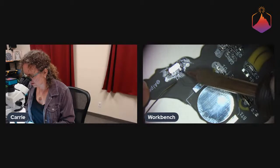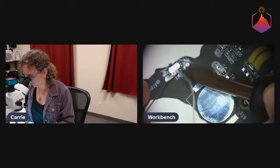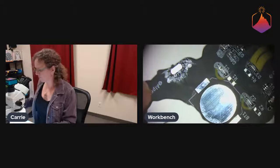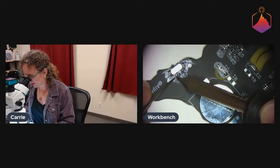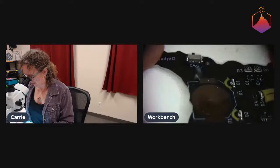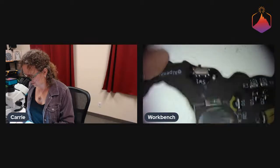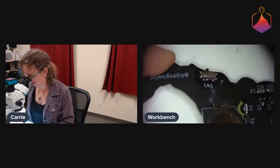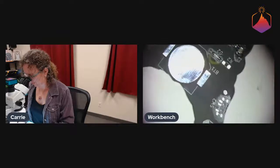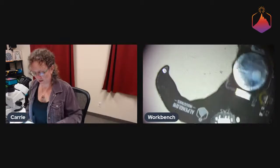Ideally this pad would extend a little bit further so we'd be able to get more surface area of the iron on the pad and heat it up at the same time. So I'm coming in from the bottom and blobbing it a little bit. The blob of solder helps it flow because the solder makes contact where the iron can't. So, that is not beautiful, but it'll work and I'm cool with that. All the way around, you can tell it's not very beautiful. I got some blobbiness going on, but whatever. It's going to work. You're not looking for IPC certification.